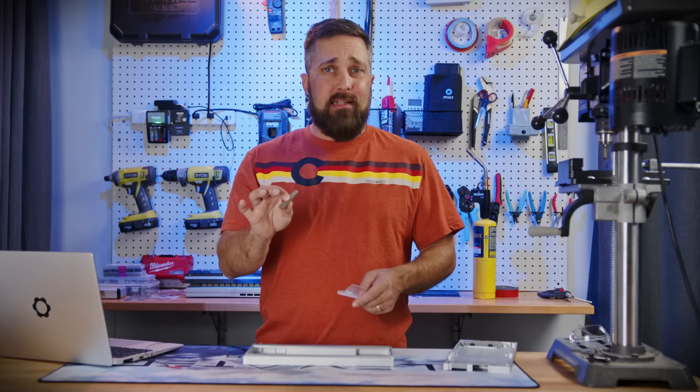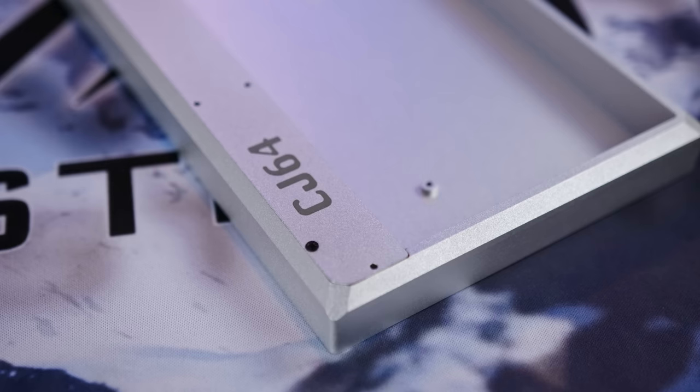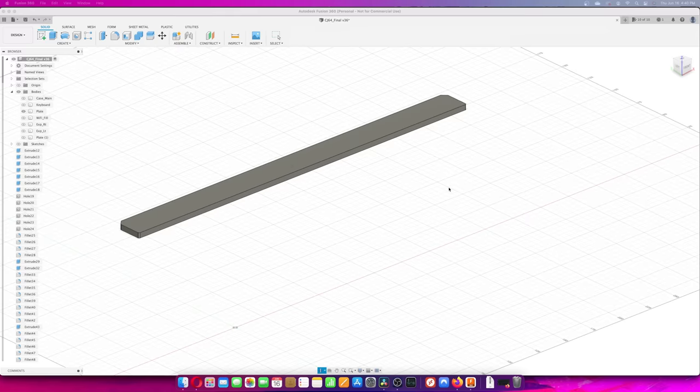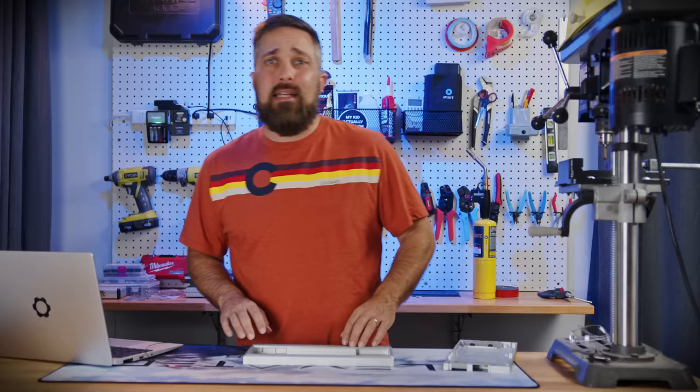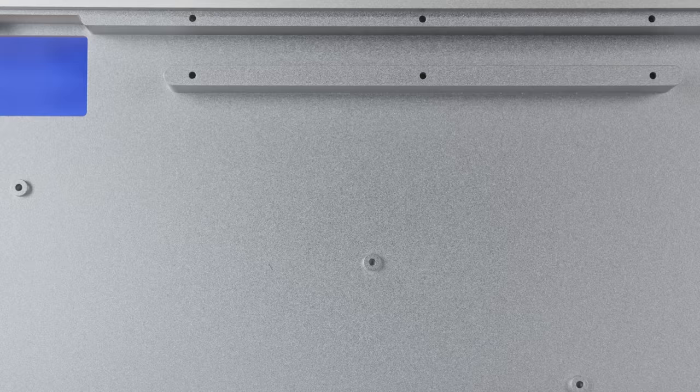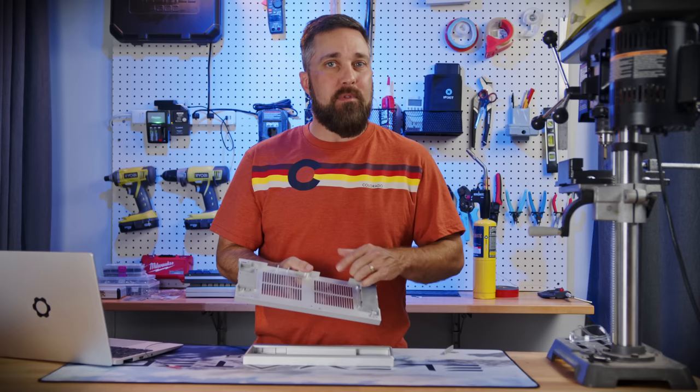And to fill the screw holes, I'm gonna use these tiny M2x4 screws, which will simply be decorative at this point, but in my design, I removed the screw holes and added the magnet pockets. Now, two other ways I cut cost was to remove deep pockets, and I didn't have any of the screw holes tapped, meaning I didn't have them threaded.